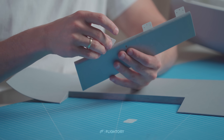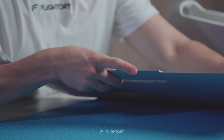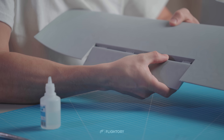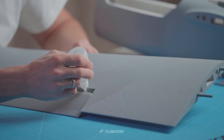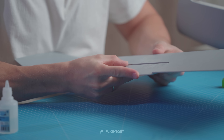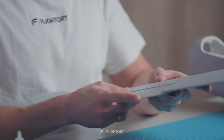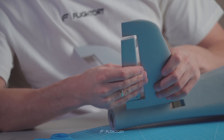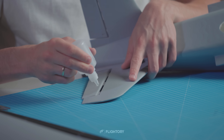I use thin polyester hinges glued with CA, and slots are already designed in the ailerons and wings to fit these hinges which measure 20x25mm. Alternatively you could buy a larger sheet and cut your own, or use other flexible materials, even printing them from TPU which works really well. To attach them, just slide the aileron a bit and soak the hinges in CA glue, moving the aileron a little to distribute the glue which will quickly bond the hinge to the plane structure. You can do the same with the rudders on the V-tail.